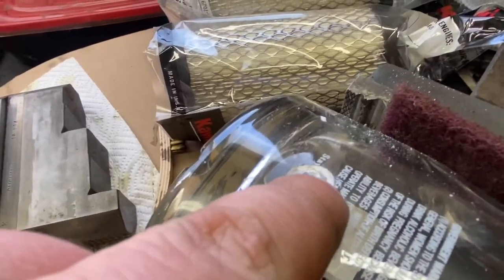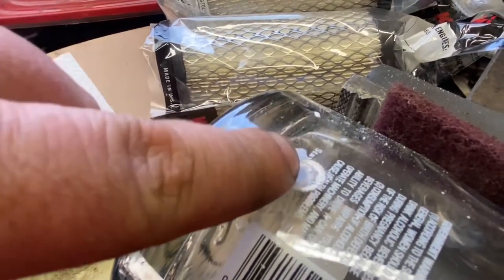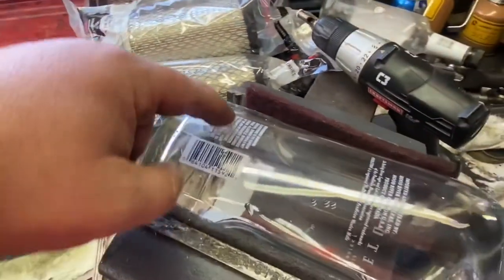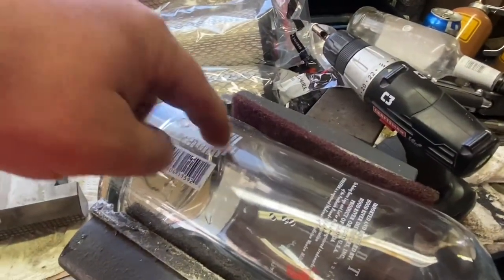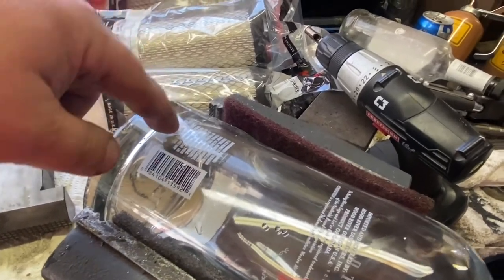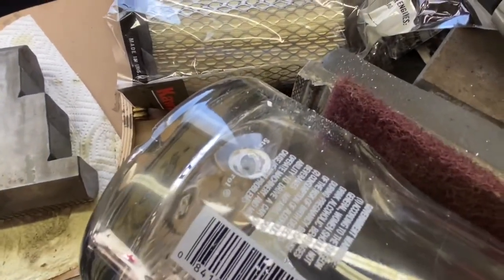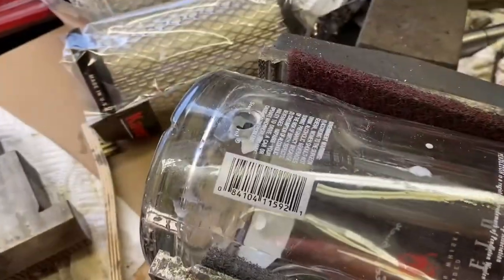The circle is now established — you can see it's darker and deeper back here, and more clear there. Now you just keep it at 90 degrees to the container. Gentle pressure — very gentle pressure — let the drill bit do the work, and it's going to punch a nice hole in there.